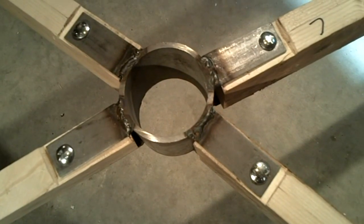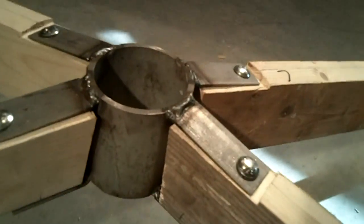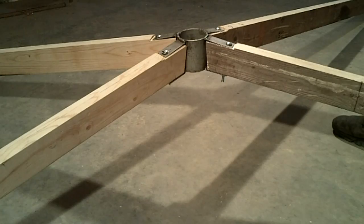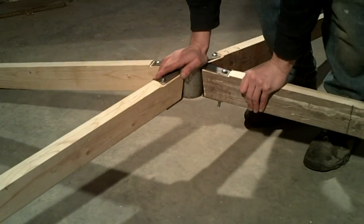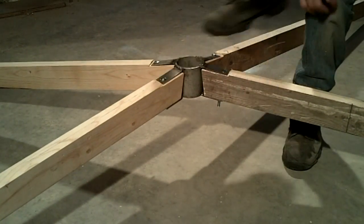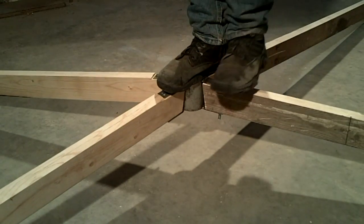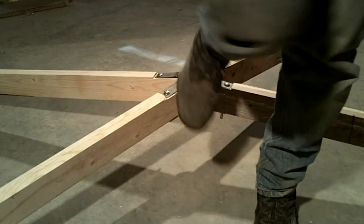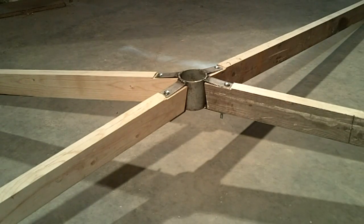This full-scale prototype shows how 4 spokes of a 6-spoke hub would be assembled. A load test shows it can support my body weight on only 4 spokes, plus none of the other struts are used to strengthen the legs. There was some slight bending of the bolts from my bouncing, but there is no hardware failure. Regardless, the final design will use 3/8-inch bolts instead of 5/16.